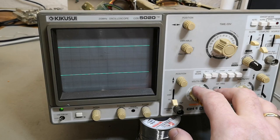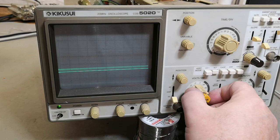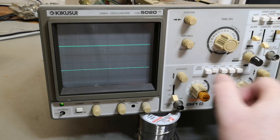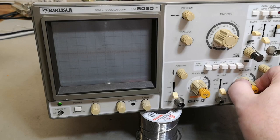All the problems I have with the channels are only related to the switches. It's just a loose connection - look at how dodgy that is. All the problem is just contacts. I just do - if I move this a little bit - so what I will do now is clean those two switches and see if that solves the problem.